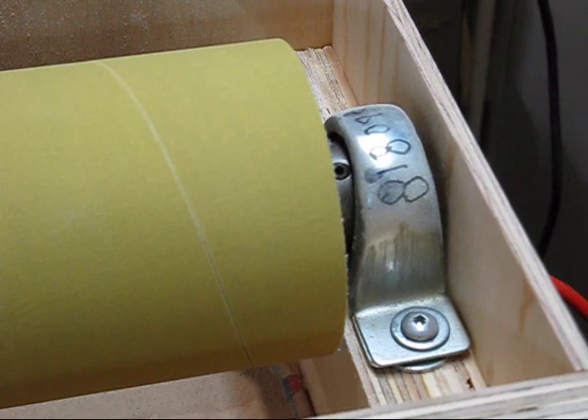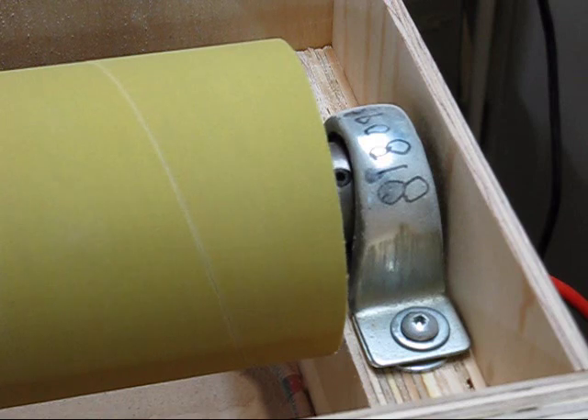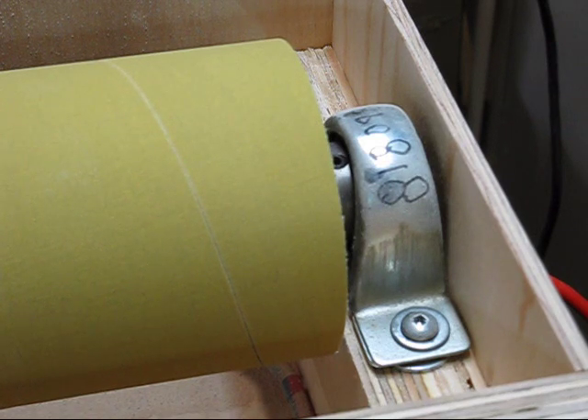At the same time I was at the hardware store, I needed some bearings. These are called pillow block bearings — the bearing spins inside a closed cover. I just have it bolted down onto some plywood and you can see there's an Allen keyhole; there are two of them. They're seven-eighths of an inch of course to accommodate the axle, so I picked up two of those, one for each end.